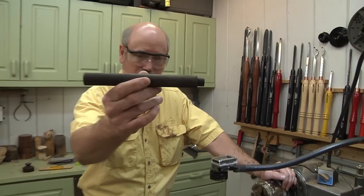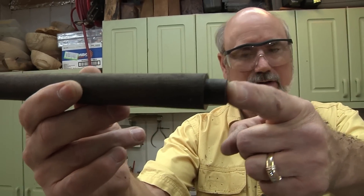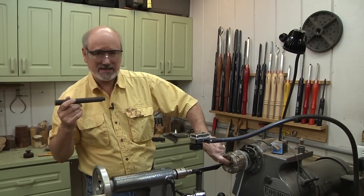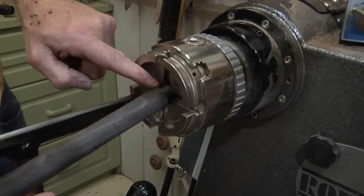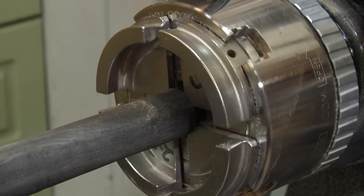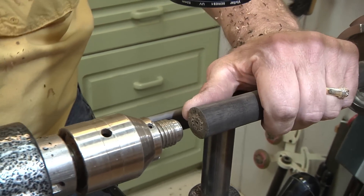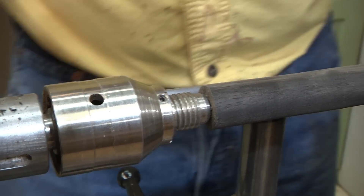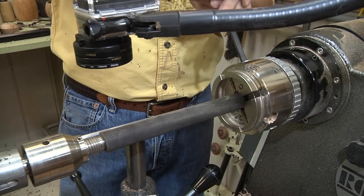I went ahead and took my blank, my ebony blank, and turned it down to a cylinder. I have a tenon on this end but not a dovetail, because I don't have any dovetail jaws small enough to hold this. The inside of this chuck has a hole through it, so you can literally pass this tenon into there. Since I made a cylinder, it's going to grip on all points. I'll lightly tighten that, then advance the quill and put that point right in the hole I had there before — all I'm doing is centering it up. Then I'm going to come back over here and just crush the bejesus out of this so I have a good tight hold.